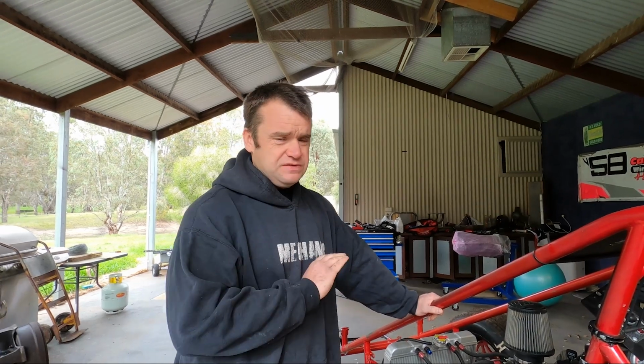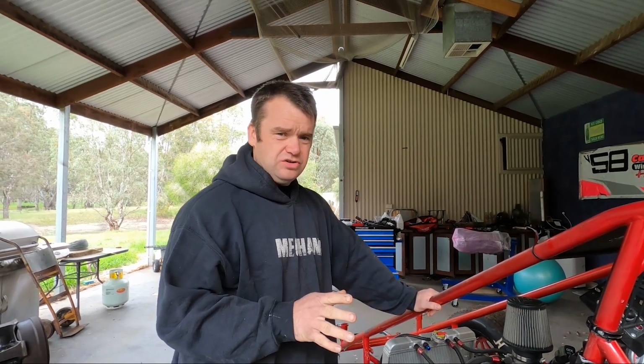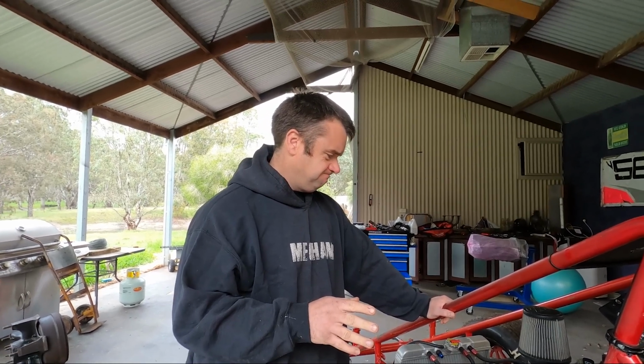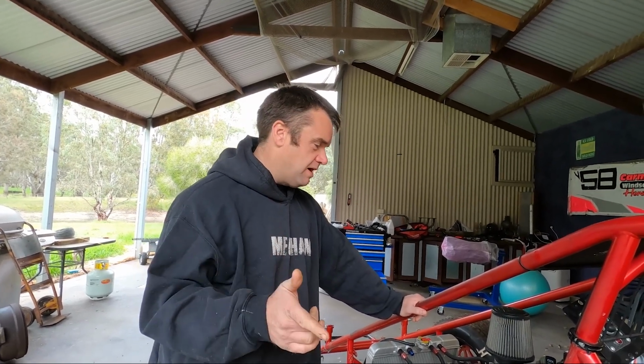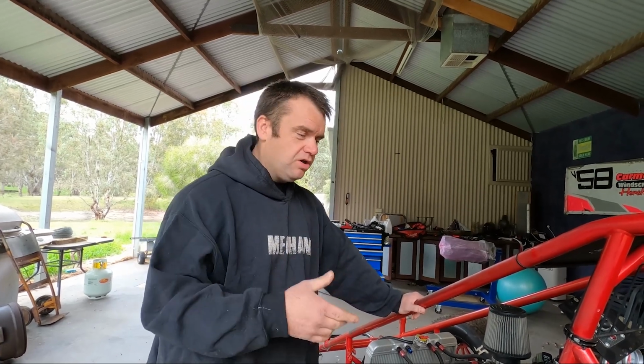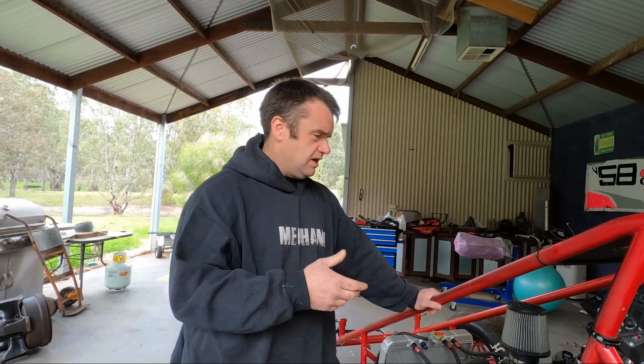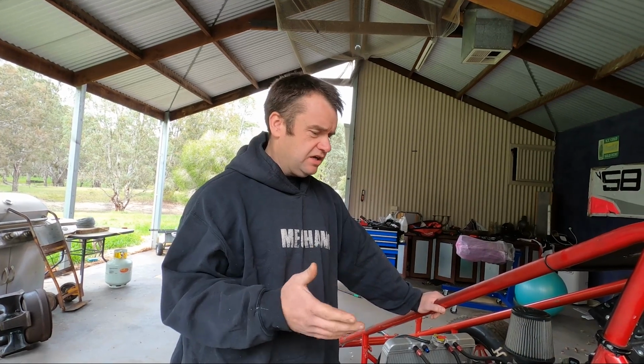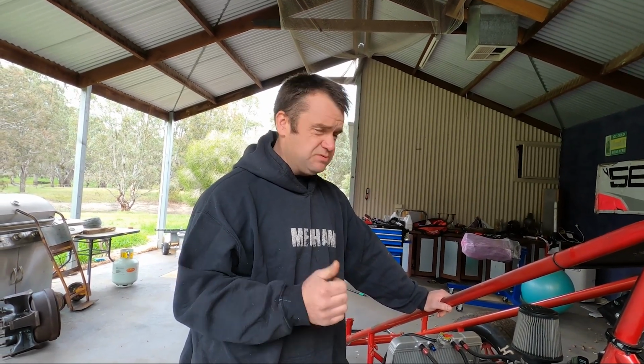But I'm way too lazy for any of that, and all I do is come out here once every week or fortnight and start the sucker up. I start it up, let it warm up, burn all the moisture, because you get a little bit of methanol and a little bit of moisture in your oil, so it burns all the moisture out of the oil when it warms up, and doesn't allow any air into the fuel system, so it can't get any corrosion. That's all I've ever done. It seems to work really well. I've never had any issues.